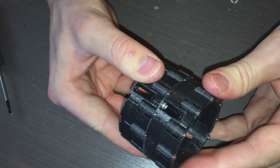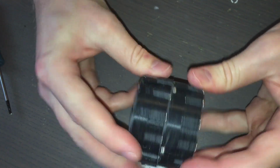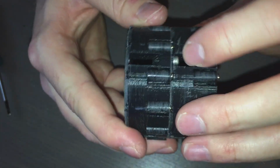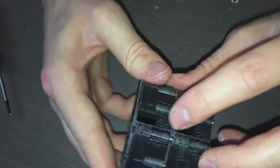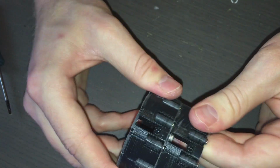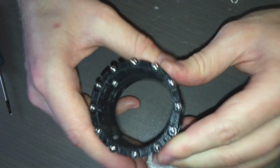That is beautiful. Okay, so these fit together really nicely, and it's a pretty stable configuration. I pretty much just have these screws going in there, but there's no female thread. They're basically expected to form the threads themselves. And I guess I made the hole small enough such that it does a pretty good job of gripping it.